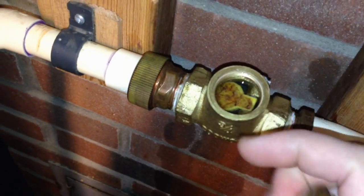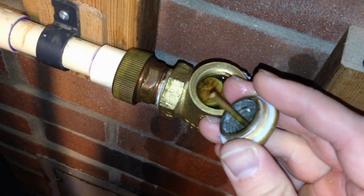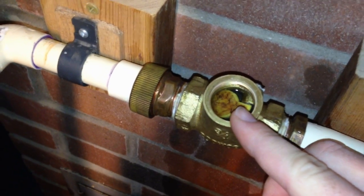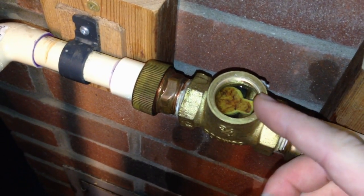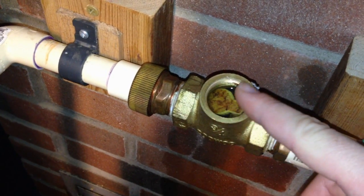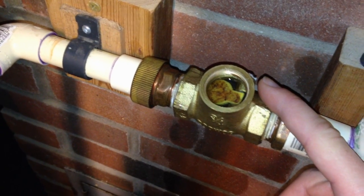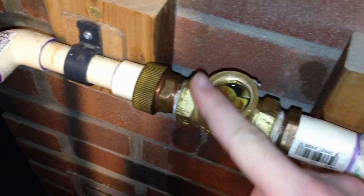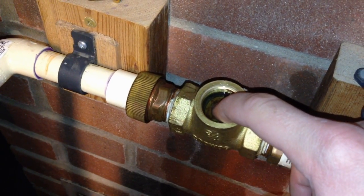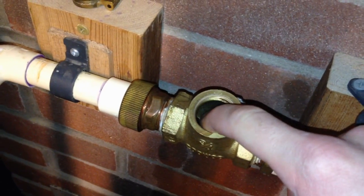The whole reason why I put this on here is not necessarily because it's not flowing. The problem is all my spigots in my house — the bathrooms and the kitchen — they all have the low-flow aerators, and I already have my pressure reduced down to about 45 psi for the water pressure. So with those pressure reducers on the spigots too, there's really not a lot of flow, so when this is sealed up, this valve is not getting enough incline for the water, when you turn the spigot on, to push this valve closed.